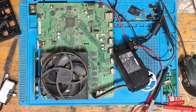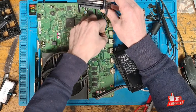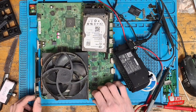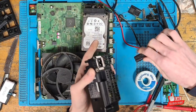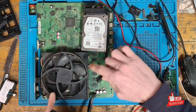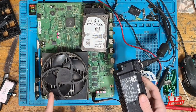Let's plug in my own power supply — not the customer's. Plugging in the hard drive and turning it on — we still get absolutely nothing. The power supply could have gone into sleep mode because it had a short connected. So let's plug it in again — and now we get the half fan spin.